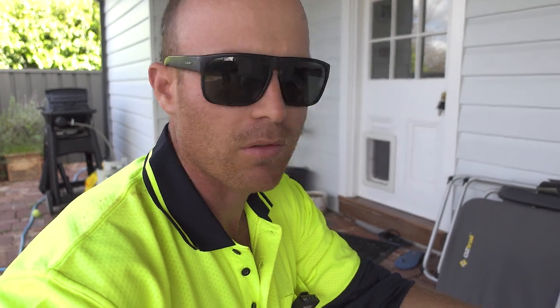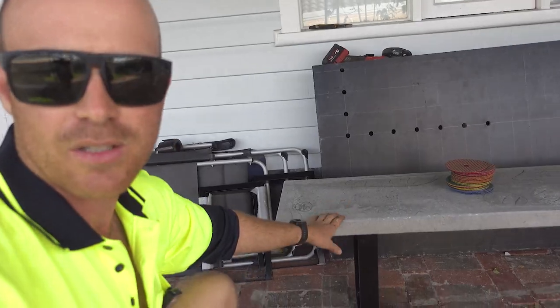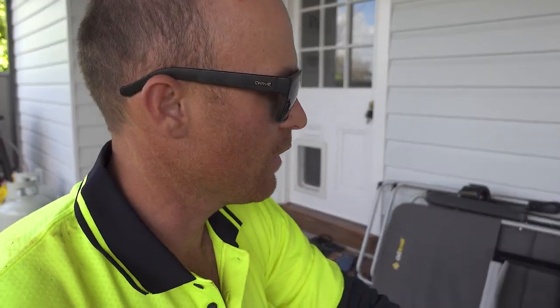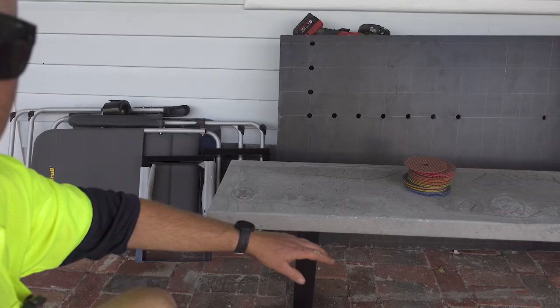With this other one I didn't mag float it — I still troweled it, partly through error but also experiment. I wanted the top to be soft so it's easier to hone. But what I've found out is when the concrete is green — only a couple of days old — and when the top layer has had the sand separate from the cement, it's more abrasive on the discs. This one has been chewing through the pads even though it's actually softer concrete. The other one is hard solid concrete and the pads are lasting quite a long time. So I'm going to take it down a bit with a really aggressive diamond blade on my grinder to get back into the harder concrete so I can hone it properly.